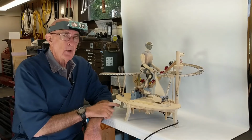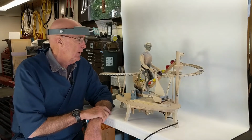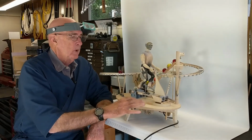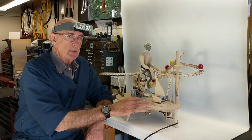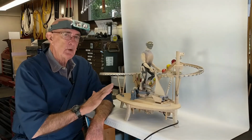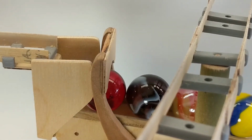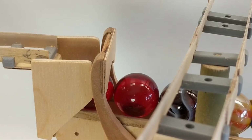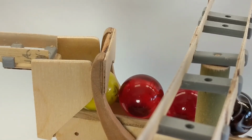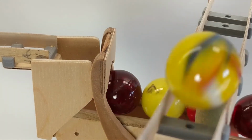The motor underneath is a 6-watt gear motor. It's very quiet, and it powers the auger and the biped, the pedals. With the elliptical pedal assembly removed, the motor remains in place, the auger turns, and I was able to create and fine-tune the marble run itself. At the end of the marble run is a magnetically charged shock absorber. This slows the marbles down and allows them to drop down onto the entrance ramp.